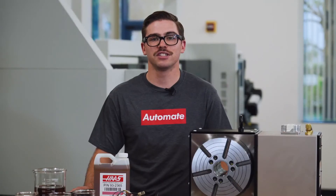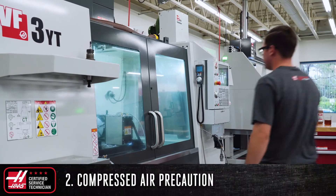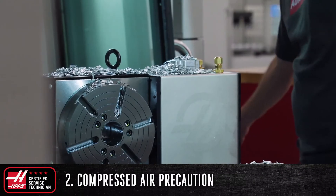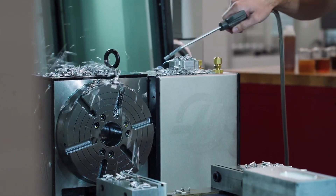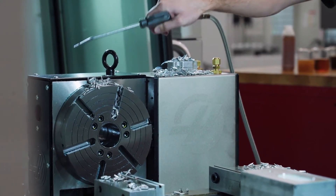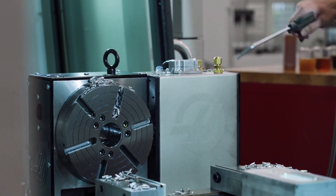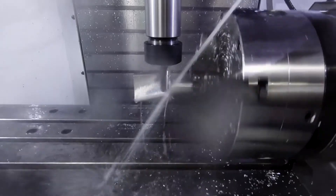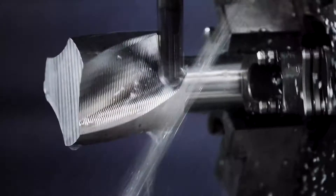Once the unit has been filled to the proper oil level, reinstall the top fill plug and reattach the top plate if necessary. This is extremely important as chips can come into the enclosure and gum up the internal gears if the fill plug is not installed properly. Your rotary is now good to go for another two years. Throughout the life of your rotary it's going to be covered with chips, so it's a good practice to keep your unit tidy and clean. If you're using compressed air to clear off chips, avoid blowing air directly under the platter, brake, or around the spindle, as the air can get in and pop off the seals surrounding these components. This can cause coolant to enter into the body and oil to leak out, affecting the performance of your unit.